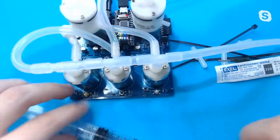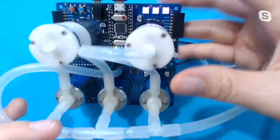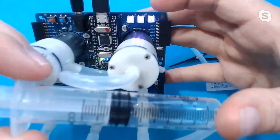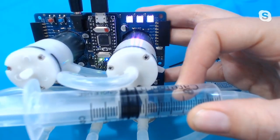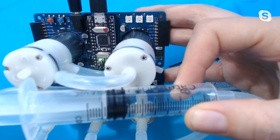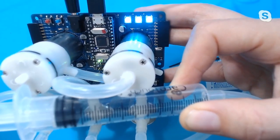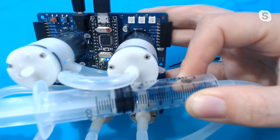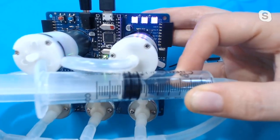You've got a few different valves, and right now I've got it hooked up to a syringe. It's running this demo app showing the pressure in the system — you can see whether it's positive or negative pressure and how intense it is by the brightness and the color. If I go here, it's basically neutral pressure. If I pull the syringe out, I'm doing negative pressure, I'm pulling a vacuum, and it's blue — it gets brighter the more I pull. And then it goes back to high pressure again when I push the syringe in.